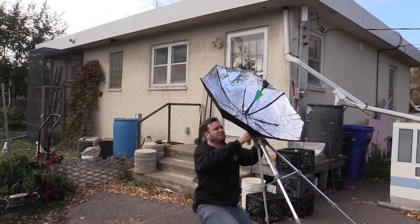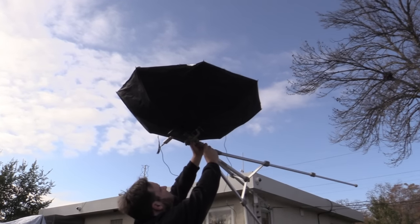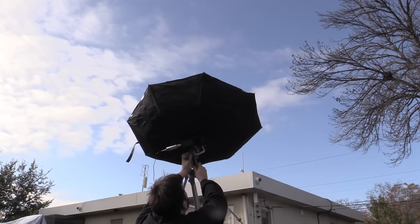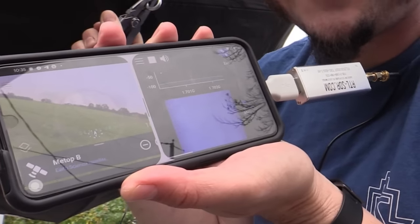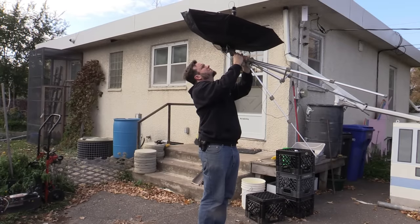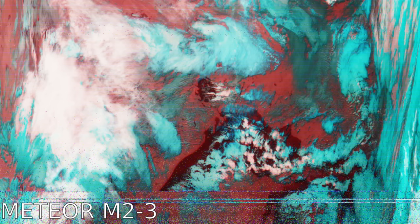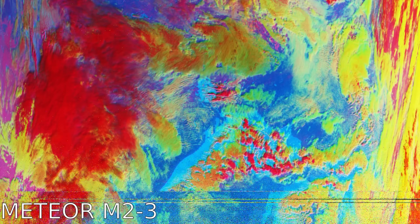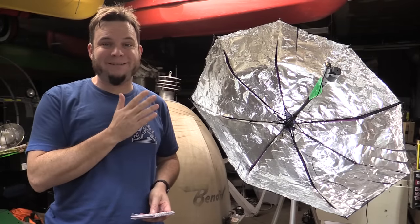After my success with the geostationary satellites, I tried a few low-orbit passes again. I did use the same linear antenna that I used for GOES. Even though it gets only about half the gain of a real helical antenna, it worked way better than that helical I tried to make just on the fly. I was also able to get both SDR++ and Stellarium apps to behave on my phone, so I could use those in split-screen mode — aim at the satellite while watching the signal strength. That's how I was able to get some of these images from various L-band satellite transmissions. All of these images were received with the umbrella covered in foil tape with the equipment I've shown here. Eventually I had to give up because the thing started falling apart — the foil doesn't really want to stick to the umbrella long term, so this is not a permanent satellite dish, but I'm really pleased with how well it worked just for being thrown together out of junk.